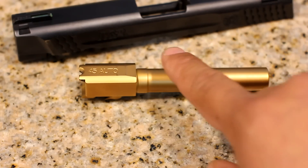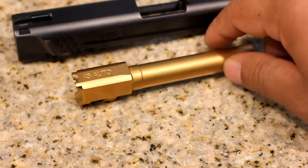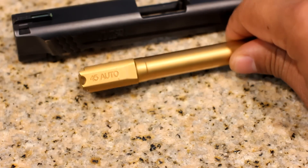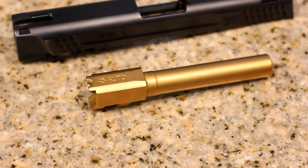It's an extremely hard surface. The TIN coating is three to six microns, so on a modern-day rifle or semi-auto you will have absolutely no interference as far as clearance — that's what's so great about it. Three to six microns is absolutely nothing; it will not affect clearance at all, even on custom Ed Browns with the really tight tolerances that those custom pistols have.